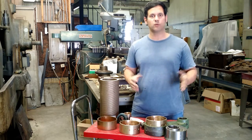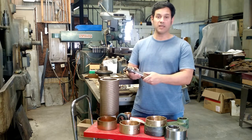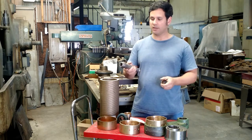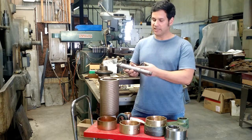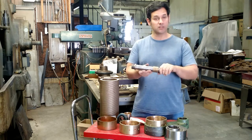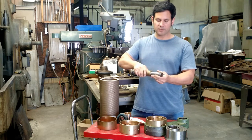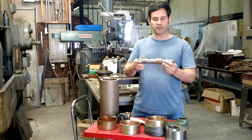So if you're building your own lathe, which one do you choose? Let me start by showing you an actual lathe spindle. This is a spindle out of an older, probably 1950s-era Atlas lathe. You can actually see some of the wear marks here. So this lathe had, during its manufacture, a bronze bushing — it actually had two of these. One bronze bushing is here at the front, and there was another bronze bushing in the back. Both of those bushings kept this spindle in alignment.